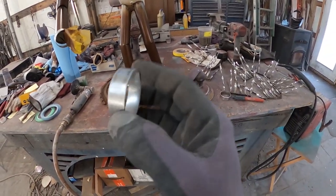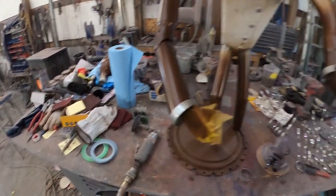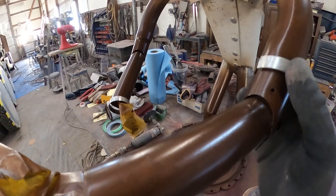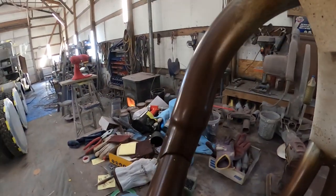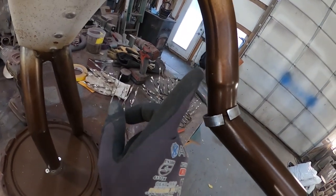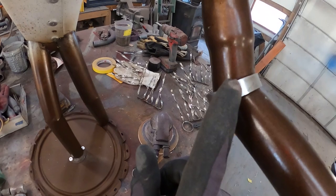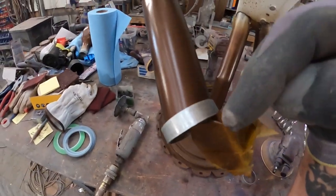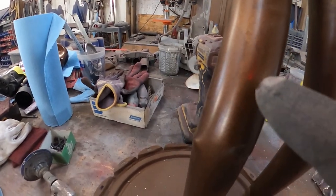I've made them, sanded them, and bent them into the correct shape. I've got one hanging here, one hanging here — already got them marked and lowered. Now I'm going to sand off the marks down to bare metal on both spots and then tack weld this cuff up into position, and tack weld another one on this leg.